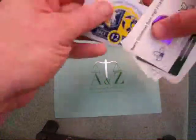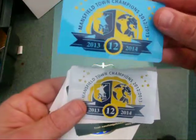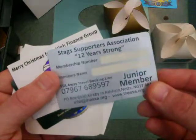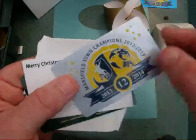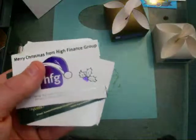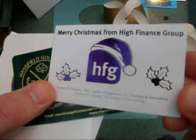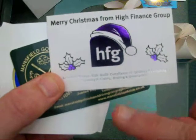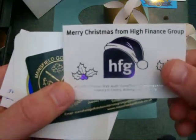These are some card jobs that we've done. The first one is a membership card. We did that on three different colours of card, and on the reverse we print again in blue but also add signature strips — you can see it's a very close registration for the piece of work. These are a few we did in the run up to Christmas — that's a three-colour job with a very small font, so I would have used a metal plate. That's actually too small to be done on a polymer plate.